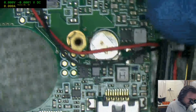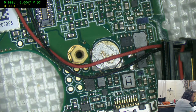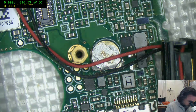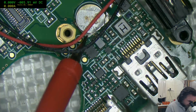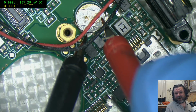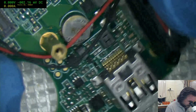But yeah, I'd say the clock battery is completely cactus, so let's measure the voltage on that. It may be because of that, it's not even bothering to do anything. Though you would think that the charging side of it would be sufficiently independent. Apparently not. Yeah, am I measuring the right things there, Paul? I think I am. Yep, I was measuring the right things. So we've got that there, and this. Well, polarity is probably wrong. I always forget on button cells it's opposite to what I'm expecting. 187 millivolts, that's really not much chop at all. That's a very dead little cell.